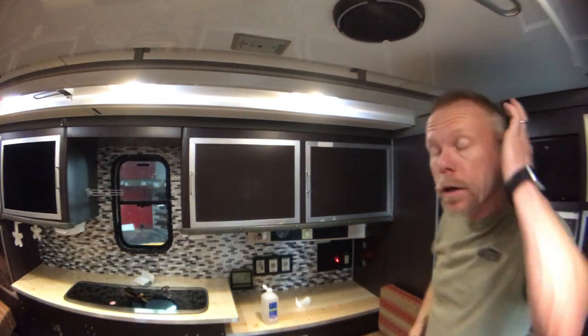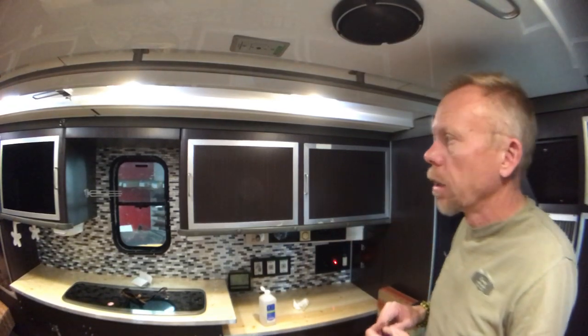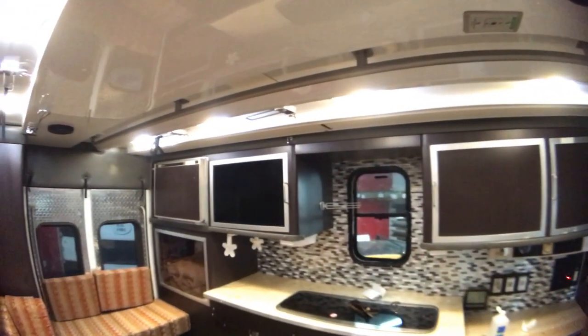It does tear very easy too, so when you cut it, when you're pulling off the excess film around the edges, pull it consistently and slowly and pay attention, because you might have not cut all the way through the product in one spot. So if you're pulling it off and you do it kind of carelessly, you could actually cause it to tear into the rest of the material you want. So take it a little easy on how you remove it to help eliminate that. So there's two cabinets done. I'll do one more and then this side will be finished.